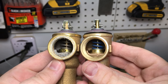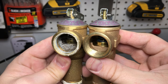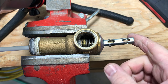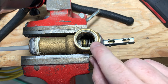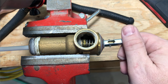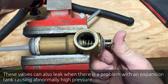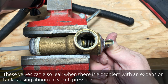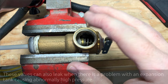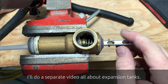Here are the old and the new valves right side by side. You can see the new valve on the right is perfectly clean inside, and the old valve on the left has a fair bit of scale built up in there. You can see how this mechanism works: when you open this valve by pulling this handle, it compresses that spring inside and pulls away the little plunger that would normally be sealing that hole. When you close it, that plunger seats on that hole again. If you've got sediment built up in there that is getting in the way of that plunger seating, that's why these fail. Sometimes you can open and close them forcefully a couple of times and that will break up some of that sediment and allow you to continue using the same valve — but really that just delays the inevitable. You should replace them when they start to leak.